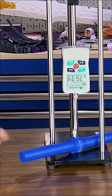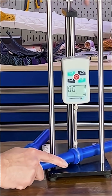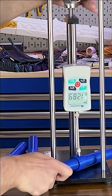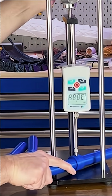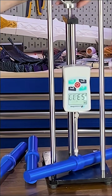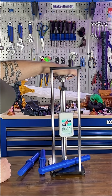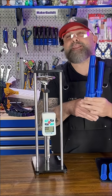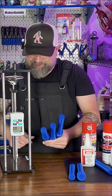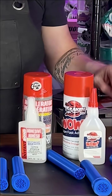It is maxed out — it is not breaking. Hear that beep? It is maxed out. Here's the Kraken — let's see if it maxes out too. We maxed out the meter, so it's about 50 newtons. We cannot separate the two pieces with any of the glues. All three passed: Instabon, Kraken, and the Loctite.